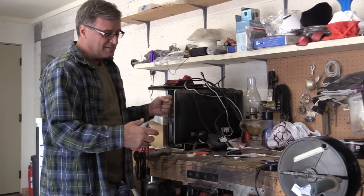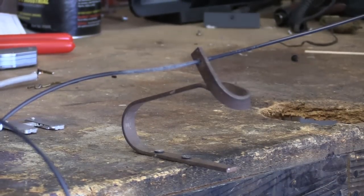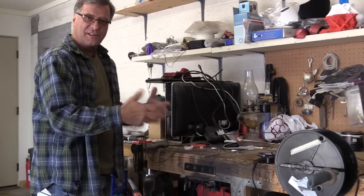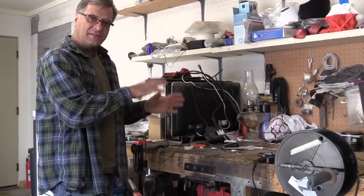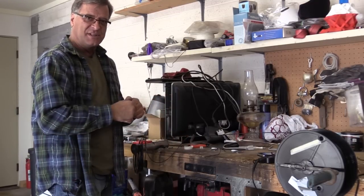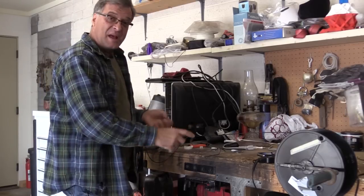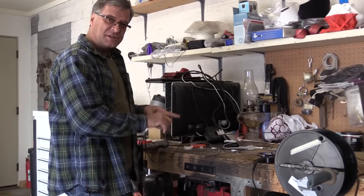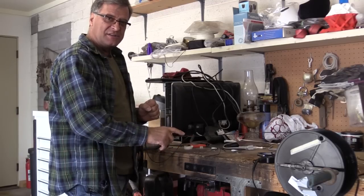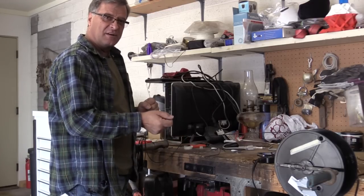Some of you were probably wondering — what exactly is this contraption? I've got a spool on that side, this bent piece of metal with a filament going through it, and this post over here with a coil on it. Well, this is something I made, just kind of threw together to work with the big eight-foot-tall 3D printer, because I was getting bulges in the filament from one supplier I was dealing with. So I made up this little rig where I could put a full spool on one side, run it through this piece of bent metal with a three-millimeter hole in it — nice, sharp, straight, square — just this perfect little hole so I could size the filament and make sure it was the correct size, because I had some prints fail because of a bulge in the filament that plugged up the machine.